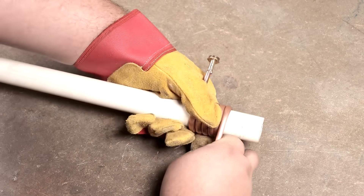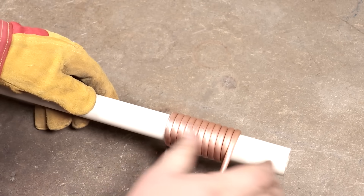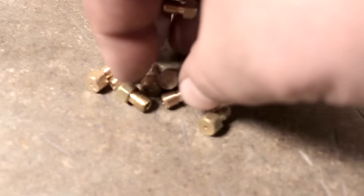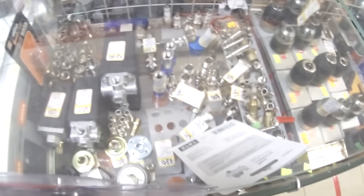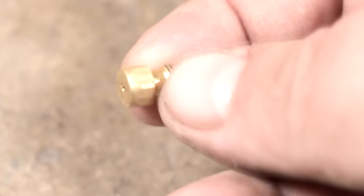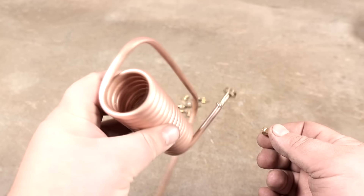I'll start with the copper tube. The tube is 6 millimeters in external diameter and approximately 2 meters long. With a mandrel for it, I took a piece of pipe from a water supply system of 32 millimeters. I did about 12 to 13 turns — optimally 10 turns. I have a whole collection of nozzles, from the smallest to over a millimeter, bought from a welding shop.